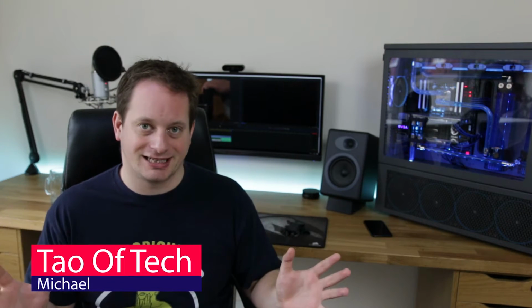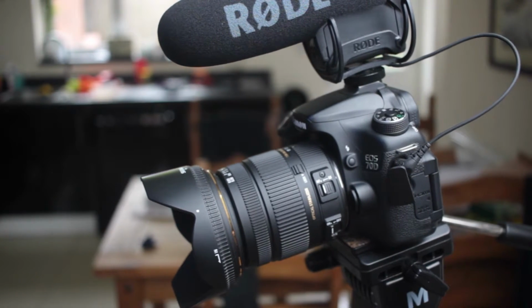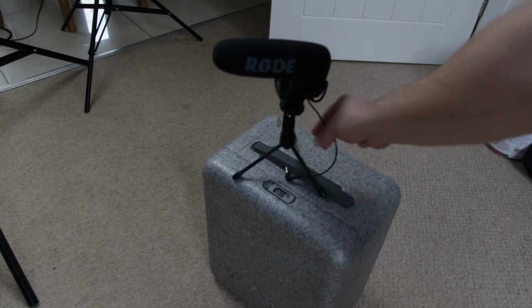So the audio that I've been using up until now has been by no means bad. It's been the shotgun microphone Video Mic Pro from Rode, which I've had attached to the side of my Canon 70D via a 3.5mm jack. A couple of challenges with this. The preamp into the Canon 70D is horrible, and to be fair to Canon, it is a camera, it's not an audio recorder. And I've also had it on a very long line, on a little tripod just sat in front of me, on my Phantom 4 box, on a very long 3.5mm line.